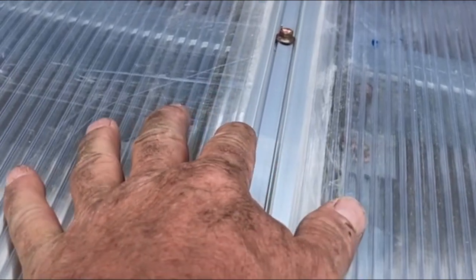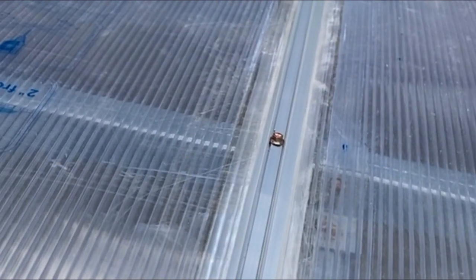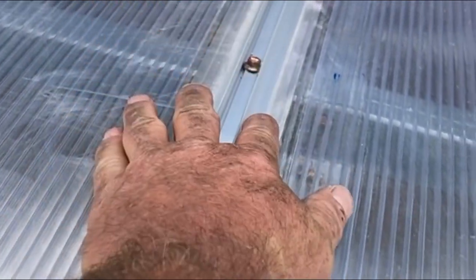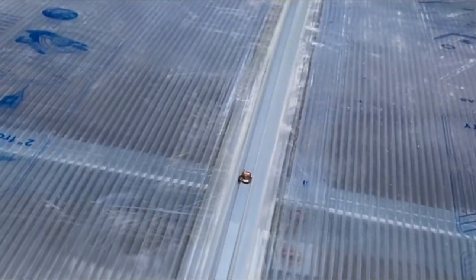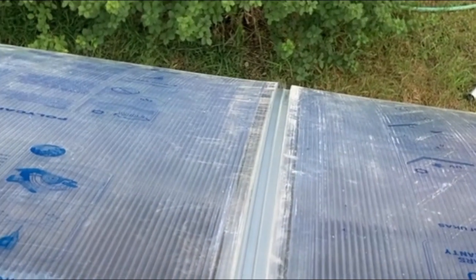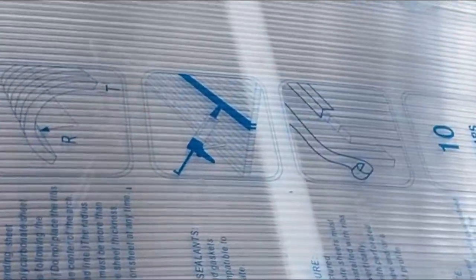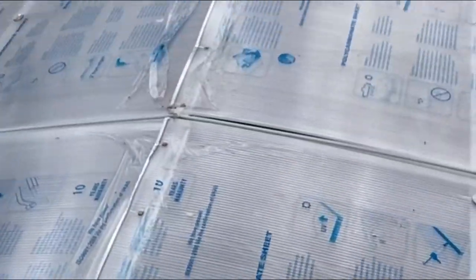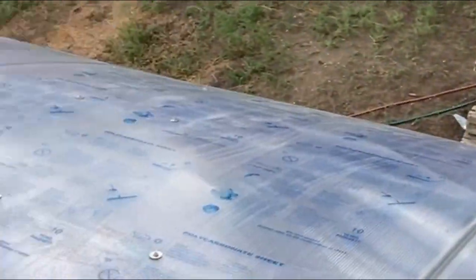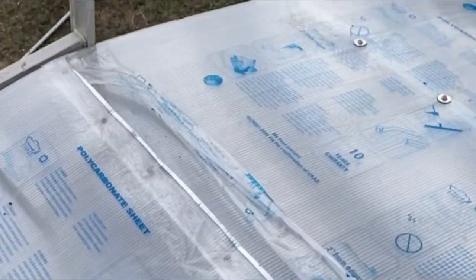You can see the gap on this side is a little wider than the other side. When it comes time to put the ridge cap on, I'll pull that screw out and shift this over a little so the gap is more even — I want it a quarter inch or less, maybe three-sixteenths — so the ridge cap will fit fine. All in all, it only took three hours to get the panels prepped and up. They roll up pretty well.